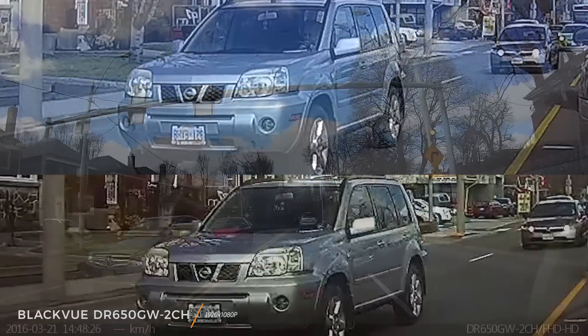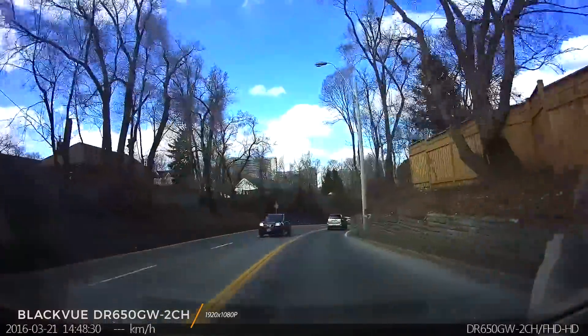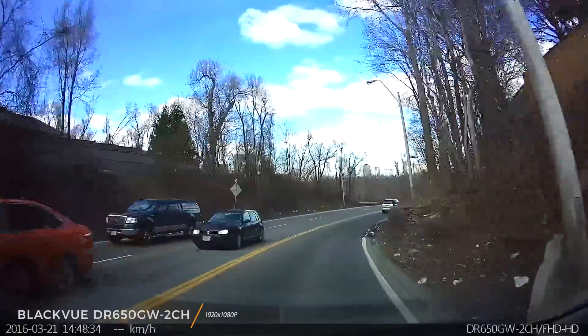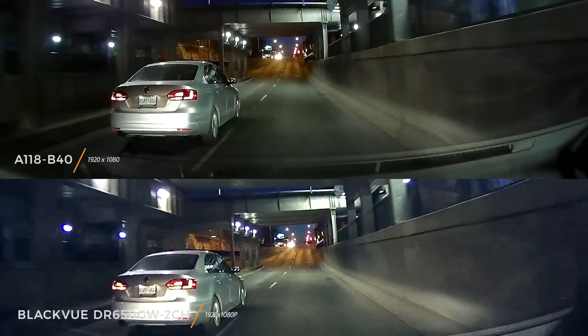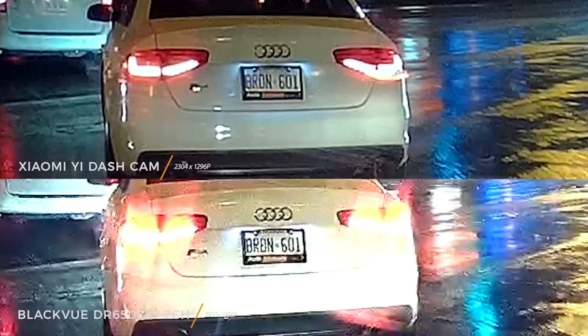This is because the bitrate is much lower than most cameras. The Cloud Edition is 6 megabits per second for the front camera, which is much less than the 15–20 Mbps on most single-lens dash cameras. This can result in severe pixelation when the scene changes rapidly. At night there's a much bigger reduction in quality — the DR650GW missed capturing license plates where cheaper cameras had no problems. In this case, passing under a tunnel, it's unreadable compared to the $80 A118C. The reduced bitrate can also warp letters — in this video you can see a D becoming a B, which could cause trouble if you need to identify a vehicle.